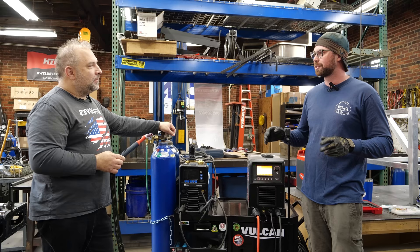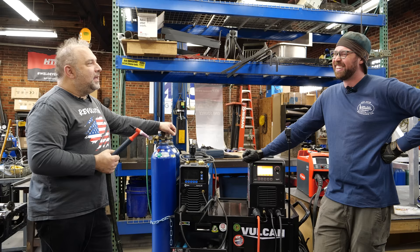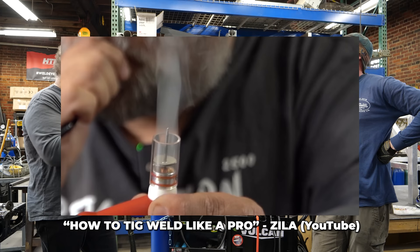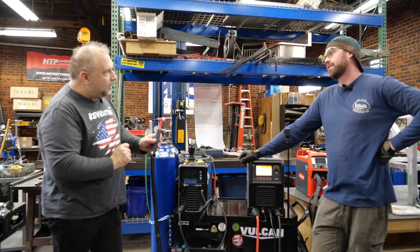He was saying keep it low — keep it at 13, keep it at 15. I think it's just that they hate lugging the big bottles around, hate paying 50 or 80 bucks for a tank of gas. We're sponsored by Arc 3, so just let it rip. But I did a video and pictured how the gas flow really comes out. The vortex doesn't really build until three-eighths to half an inch out. And this electrode is three-sixteenths out, so you're clean. It's calm where you're welding.